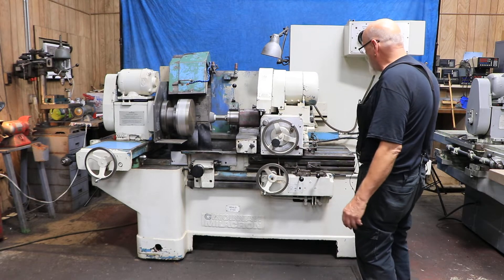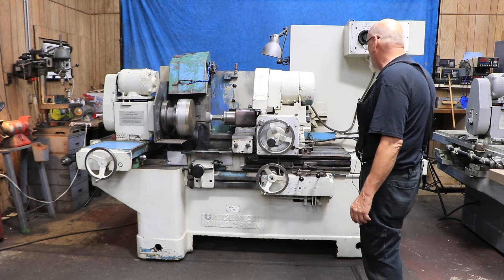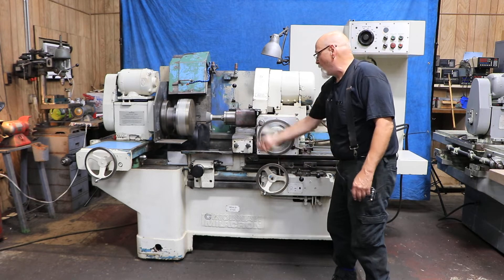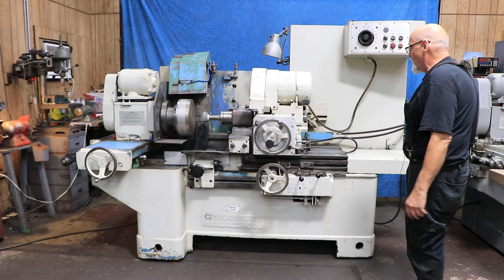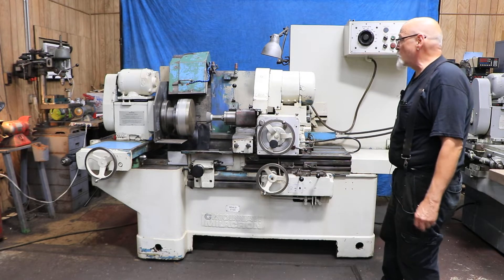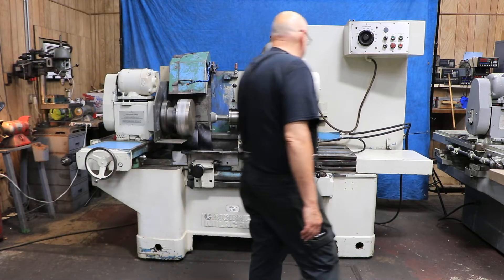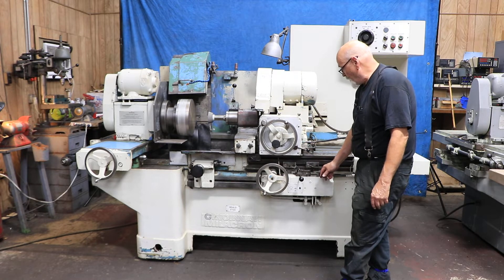This particular model has oil hydrodynamic or hydrostatic ways on the saddle, the cross slide going in and out, the table, as well as the cross slide going in and out. This action here is also floated on a thin film of oil. That adjustment is critical — it's within microns, actually. There's special oil that goes in these machines, special filters to filter the oil, so you always want to make sure you use the right stuff. When you use the right stuff, you're going to have a table that moves and can even move faster or still go very slow.